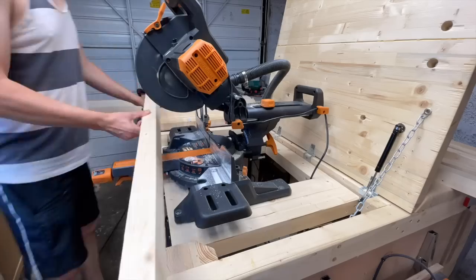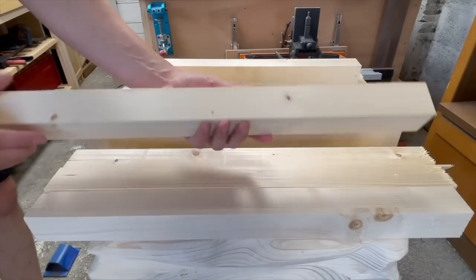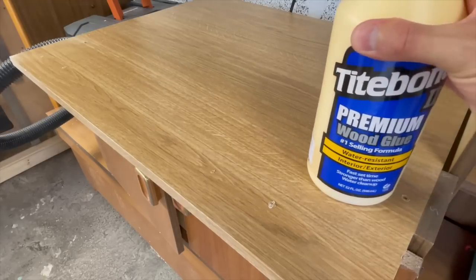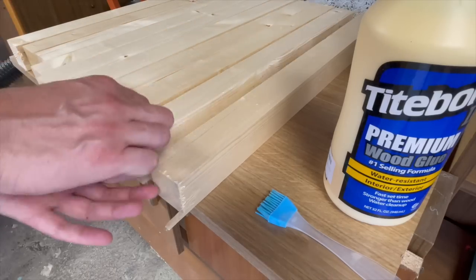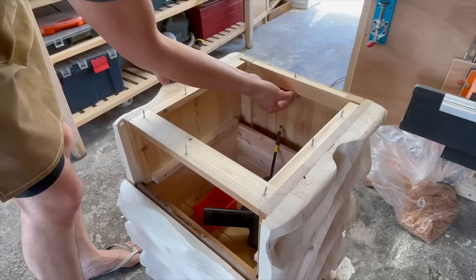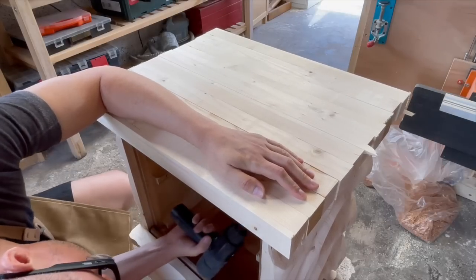As I already mentioned, in order to achieve this organic and natural look, I used the same wood for the top. As I was not going to carve much from the top, I chose the best side of each piece to make it look nice together. I used the existing holes for the screws to attach the top, and I used the jigsaw to give it the rough shape that I wanted.